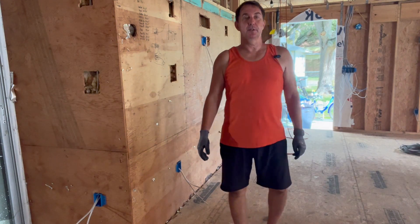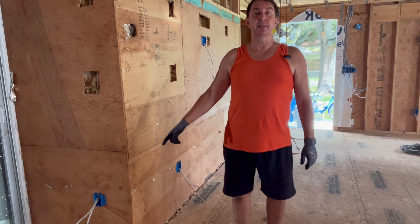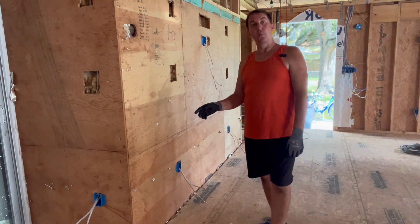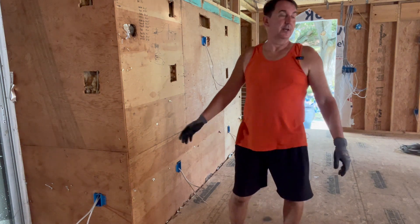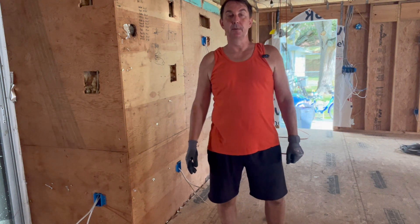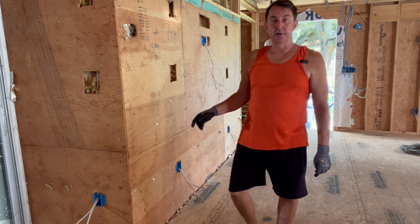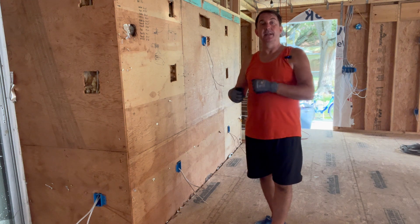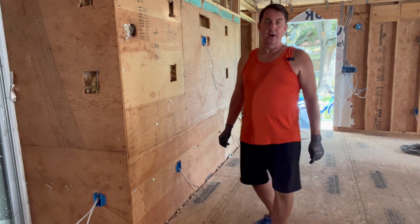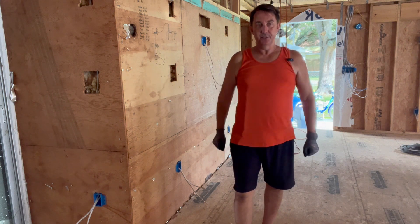Morning guys, welcome back to your Florida Electrician. On today's video, I would like to cut in some outlets. In this home addition, we've added a whole bunch of outlets along the floor, of course where they typically are. The wires are run, and now we need to cut them in in preparation for putting the actual outlet. We need to connect the grounds together and prepare the wires, so after drywall and insulation go up, we can quickly go ahead and install our devices.